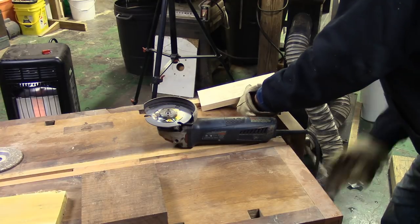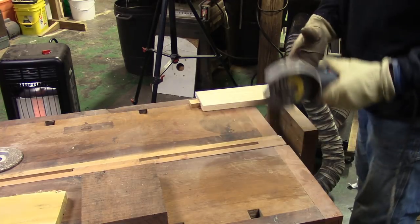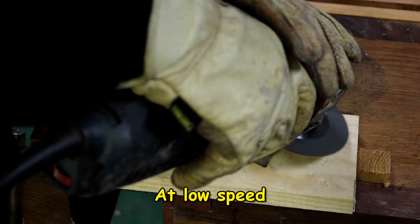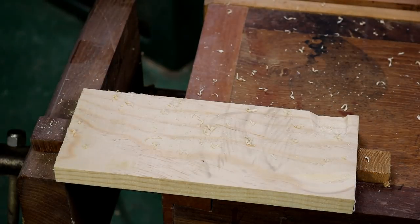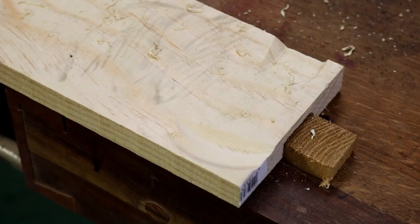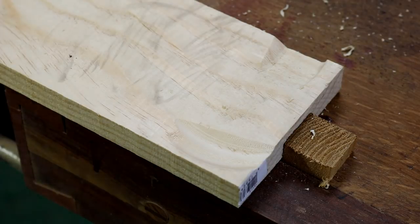Here's a little piece of pine. Here is what the Graff does to pine at low speed. You can see the with-grain cut is actually very smooth; the cross-grain is a little squirrelly but still not all that bad — it did cut, and I think that would be sandable. Now let's try it at higher speed.